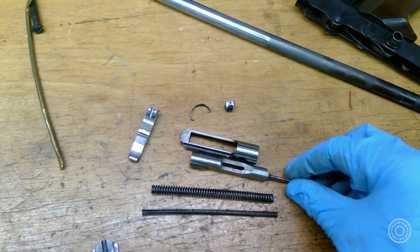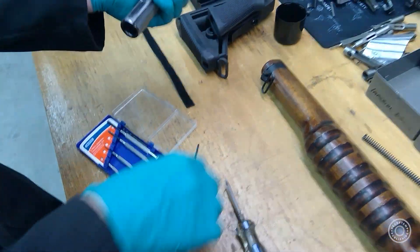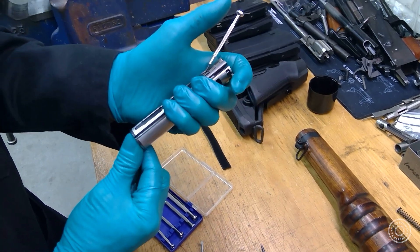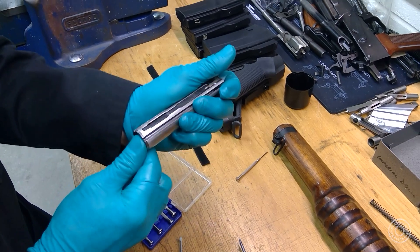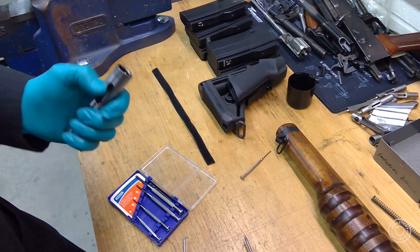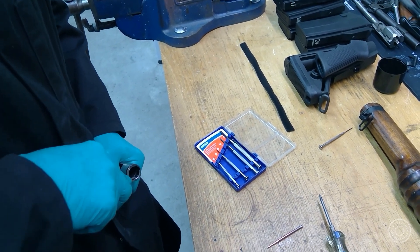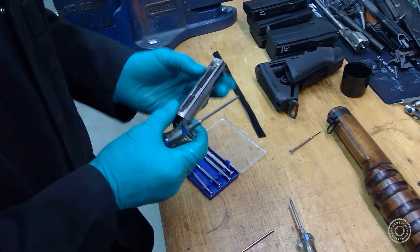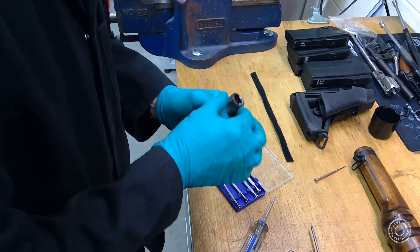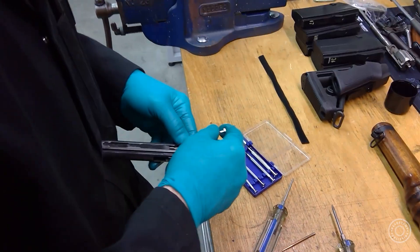You've got your firing pin sleeve and firing pin. So the way this strips down — you've got it lifted above the sear, then push the back end of that spring up and push it forward. See why you weren't entirely keen to do it — every time you do this you risk setting the spring slightly. If you'd told me that I would have just said don't do it. It's not coming off. Failure is always an option Mike — no, never fail.